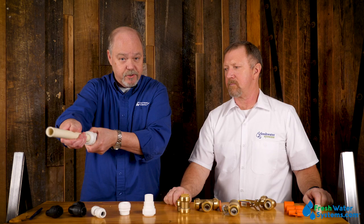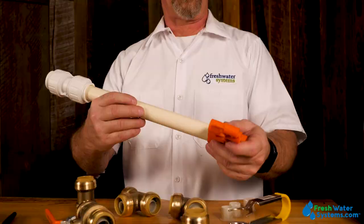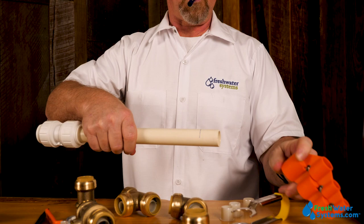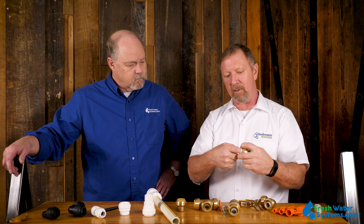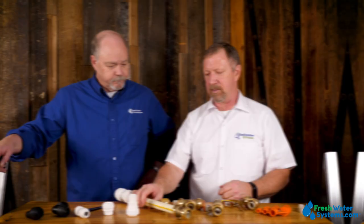The SharkBite works very similarly. When you cut the pipe you're going to have some burrs on it, so SharkBite has a handy deburring tool — you just put it on there and twist to take any burrs off. It doubles as a marking and measuring tool so you can mark right on your pipe to make sure you have enough depth. Inside the fitting there's a tube support, which you definitely have to use for PEX pipe but not for rigid pipe. You can press on the collet ring and pull the tube support out, then line the pipe up and push it in until it stops, making sure you've got plenty of depth to seal against the O-ring and that the seal is good on the pipe.